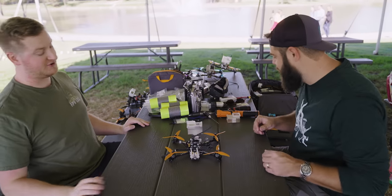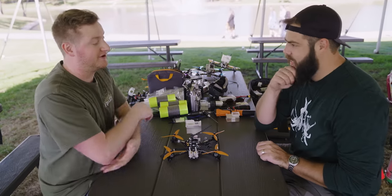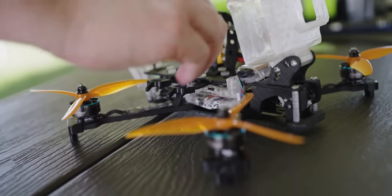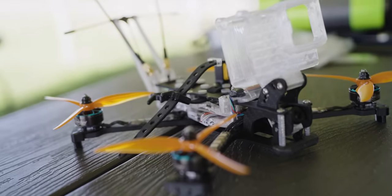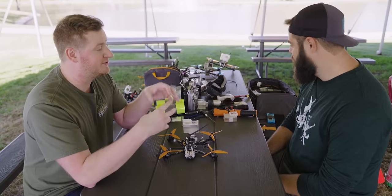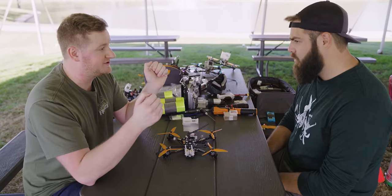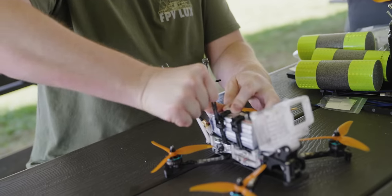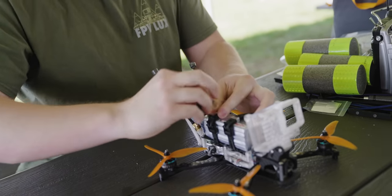These are different battery straps — the straps were a huge part of figuring out version two. These are quick-release buckle rubber straps, and those make battery changes with the float system insanely easier. They're a little stretchy. You want to crank these down as much as you can — really pull. That is cranked on.